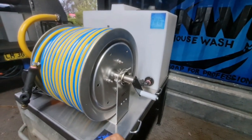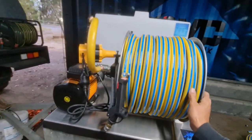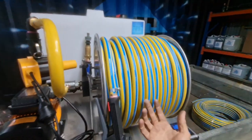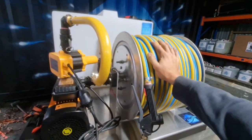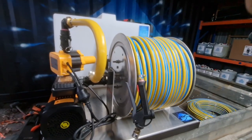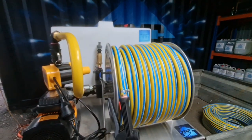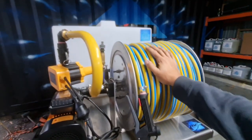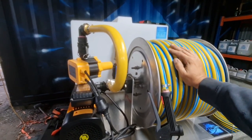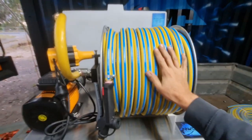At the end of the day, if somebody really wants a custom one with a bigger tank we can do that — just send us a message. Onto the hose reel, we've gone with the Valley soft wash hose reel, mainly for the stainless internals. We could have cheaped out and kept the price a little bit lower and used a steel A-frame, but at the end of the day you're using chlorine — it's going to rust it out. It's better off spending the money; this is going to last you many years whereas a steel one, in a few years time you might have had to look at replacing it. It comes with 65 metres of hose — this one's got a little bit more, but they will come with 65 metres because that works out better with the rolls, and it's pretty close to capacity anyway.